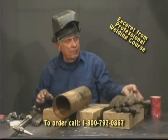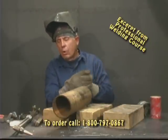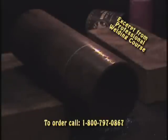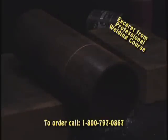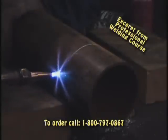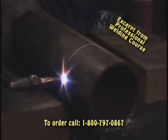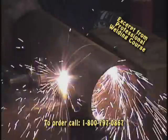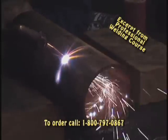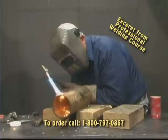Let me just show you how to make this cut — it's no different than if you were cutting a piece of quarter-inch plate. This pipe is a thin wall pipe, about a quarter of an inch. Let me light off, get in position, get comfortable. Decide which end of this pipe I want to keep — I'm going to keep the long end, so I'm going to start my cut outside here. As soon as it heats up and gets shiny, go through it, pierce it, then I'm just going to come up, keep it in line. When it feels uncomfortable, I'm going to stop and make myself a little circle.